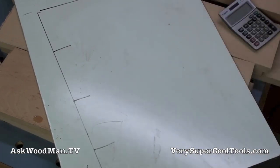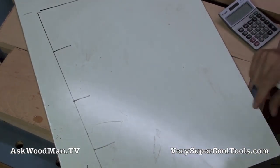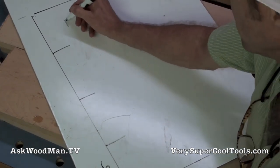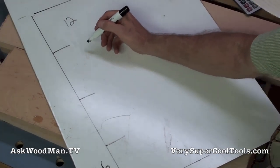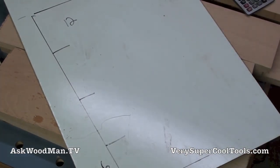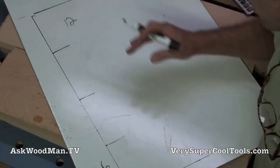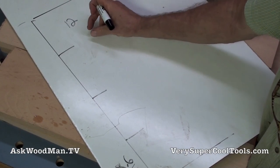One piece of information that will not change is the height from the bottom to the top: 58.6 centimeters. For the first technique, let's say I want the top drawer to be 12 centimeters, and then each drawer below that gets an equal addition. What we're solving for is: what is that equal addition needed to make everything lay out correctly?